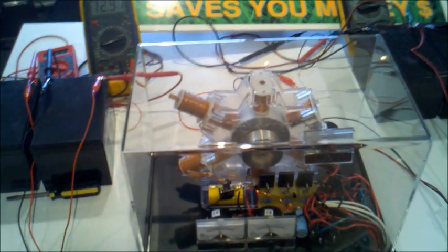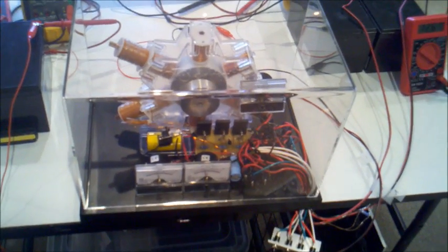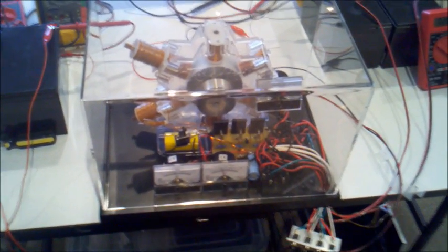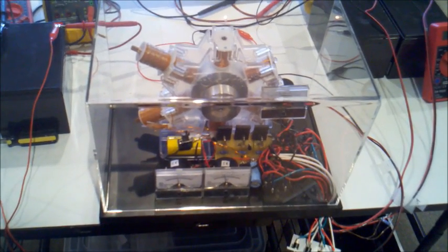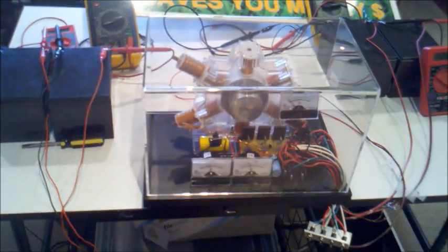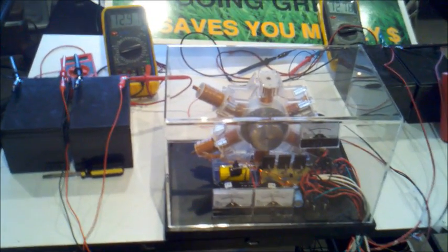We're looking to bring out the battery swapper in its full form with optional larger relay contactors — up to 200 amps to handle larger systems. For now there's a 10 amp limit on these particular relays, but you'll be able to upgrade as soon as the larger relays are available. You can also use the same control system to drive external relays as large as you want. It will be computer controlled — you just decide what voltages you want to use and it's walk-away operation; it takes care of itself.